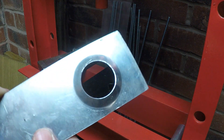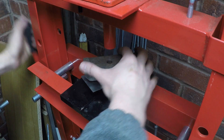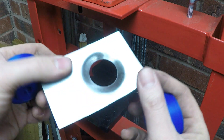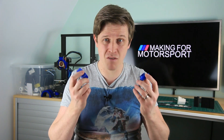If you don't have a press, you can use a vise. If you don't have a vise, you can use a bolt. So this is 1mm aluminium — not that challenging. But check this out: 1mm steel. Yes, you can go out and buy the hardened steel ones, but you know you're never going to have the right size. And if you need a new size, you just print another. If it wears out or breaks, you print another. Need it a bit stronger? Print it with more infill. This is the future, boys.